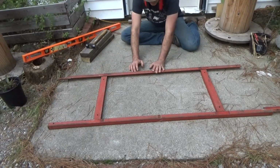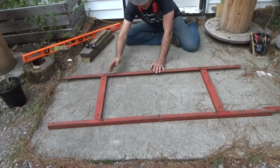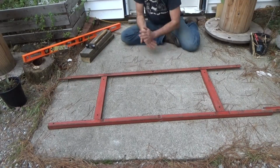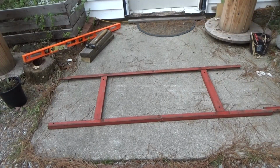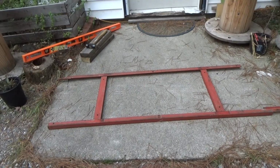if I put this on the end, the mill head itself is going to end right up in here. So there's only a couple inches left of the lug that's ever going to be on this edge. So I can't imagine that could cause any damage there. And any 1/16 of an inch can be planed. But that being in the middle, and you got a 1/16 of an inch, and you start to rise up, by the time you get to the end, you could have trouble. So I'm going to take it over and piece it in and see how it looks.